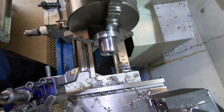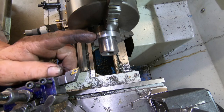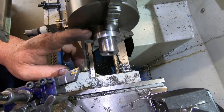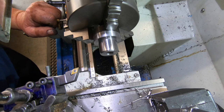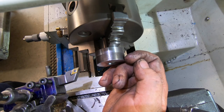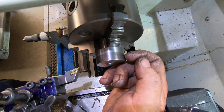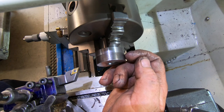Good. Guess now I can flip it, and I'm just going to machine this end off here, the leftover, and clean that up. And that piece is, I'd say, as good as finished. I'm going to machine all this off, which shouldn't take all that long, and then I'll have to put a little counterbore in for the head